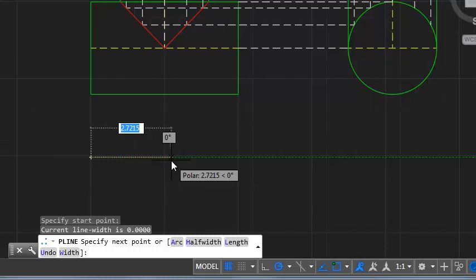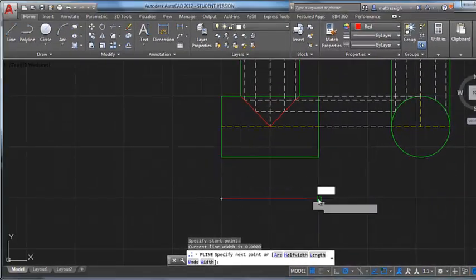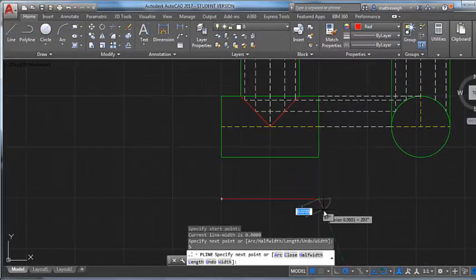Our header length is bigger than our branch so that we can fit our branch and get the development out of it. But this header length doesn't have to be that big. This existing pipe could be really long, and that's fine. We're just doing a pattern to fit into a particular area, or we're making a T that will fit into an area and then we'll pipe to it or something. So if we need a 6-inch long header, that's fine, or whatever it is. The one we've chosen to start with here was 5 inches long, so that's just 5.